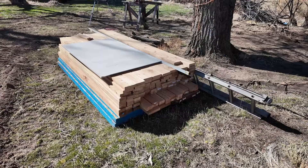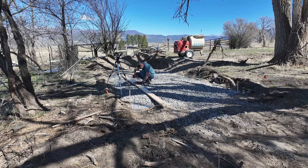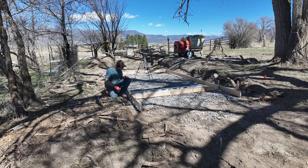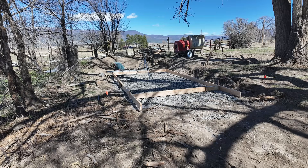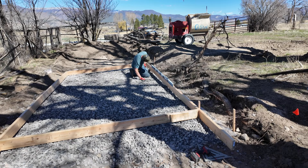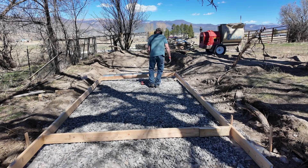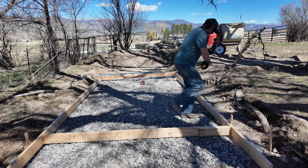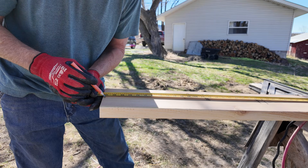The lumber bunk for this project will fit inside the bed of a standard pickup truck — I kept everything at eight-foot lengths to make it easy. When I framed up the form, I made sure not to cut anything I didn't have to, so I could reuse these form boards as rafters in the structure. I got everything leveled with stakes and got the perimeter established, starting on the high side where the frame is closest to the ground, getting that one side level and then raising the downhill side to match. There's a little slope to the building site, which is good for drainage. Then we pulled corners to make sure everything was square before setting the last corner and got to work framing the inside of the bond beam form.